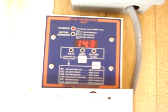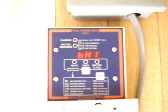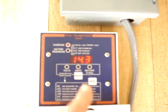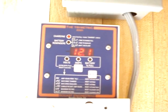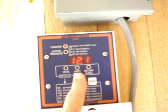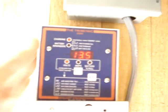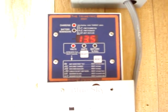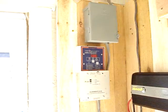This is the highest voltage that this system has reached since I reset it. 14.3 volts is my highest, and the lowest it's dropped down is 12.1 volts. That's the Trimetric 2020 — it's about 160 bucks. Might sound a little pricey, but you're going to want all that information to maximize your efficiency.